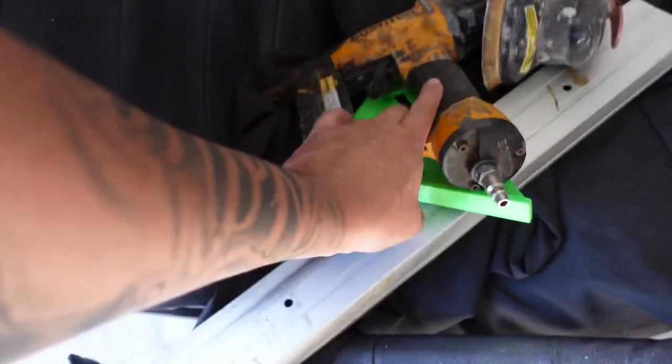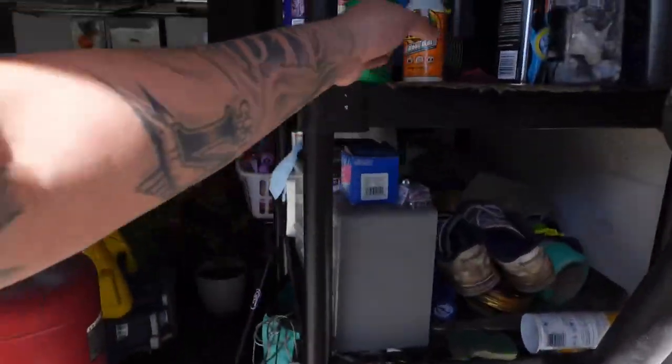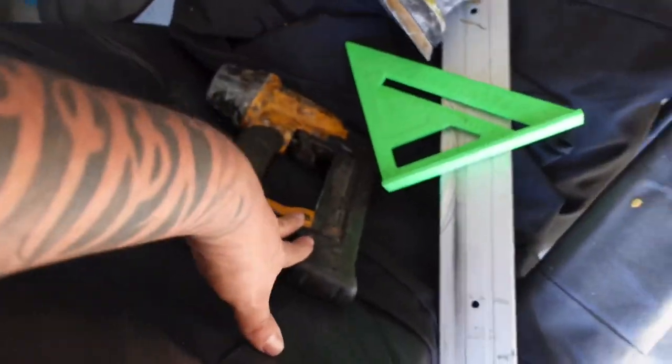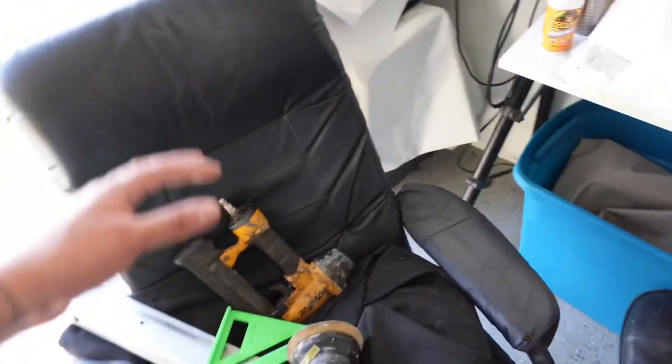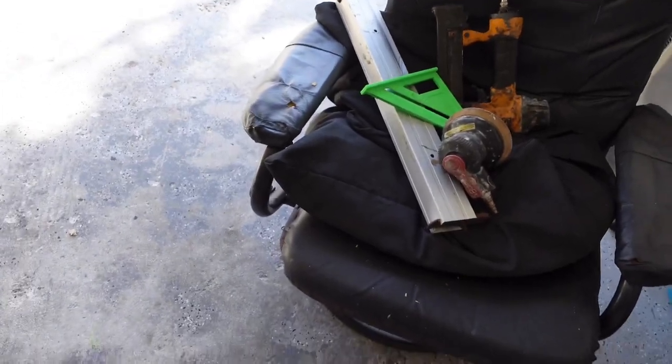I got my stapler that I'm gonna put stuff together with, and always wood glue all your stuff together so it never falls apart. I've seen people build panels and they fall apart after a few months just because they didn't use glue. The Gorilla glue is no joke. We use quarter-inch crown staples so it'll really bond well.